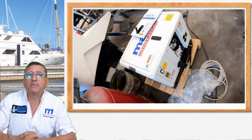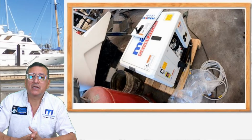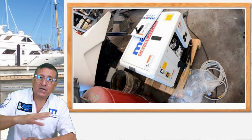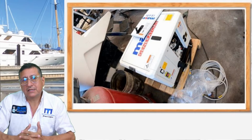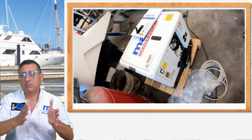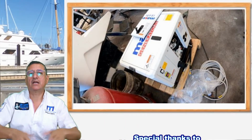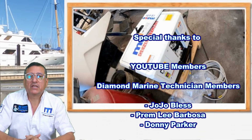Remember that the enemy of the back end of the generator is the water. You need to keep the generator in a dry area and be 100% sure that the generator will be dry all the time. It doesn't matter if you have water in the bilge, the generator should be located in a dry space. That design originally was bad, because the generator was at the bottom of the boat, in the back of the boat, close to the transom. The water accumulates in that area when the boat is running. That's not good. Right now, in the new position, the generator is dry.